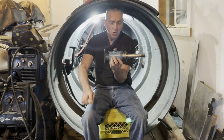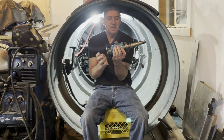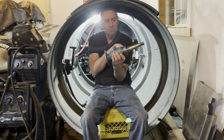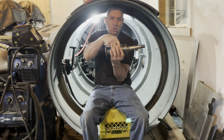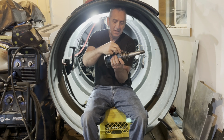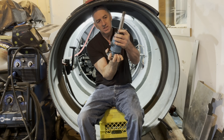This has two tapered bearings in it, like a typical wheel bearing would be. And so what I did is I took the boat propeller shaft and I machined it so that a hydraulic motor just plugs right into the back here. This is an oil reservoir, and there's a rubber lip seal, and then I put a mechanical water pump seal. So this is a spring-loaded seal.